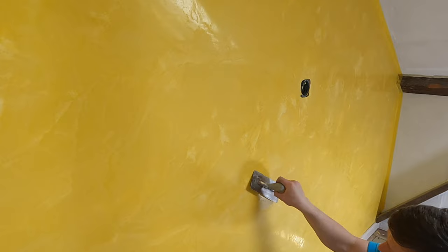Coming back on myself and giving that area its final polish — its final burnish. Burnish is just another name for polishing, that's what Venetian plasterers call it. I polish both horizontally and then vertically, which helps flatten it, gives it a sheen, adds a bit of compression, and brings it all together. After finishing the sections I came back and gave it all one final quick polish, which really brings out the shine. You can see how shiny this product is — it's reflecting the lights. Red color I think shows it even better; maybe red or black next time.